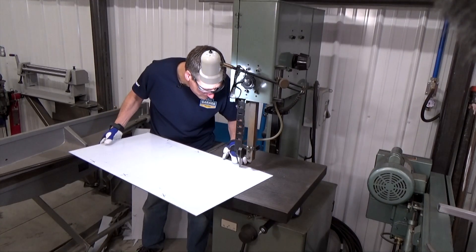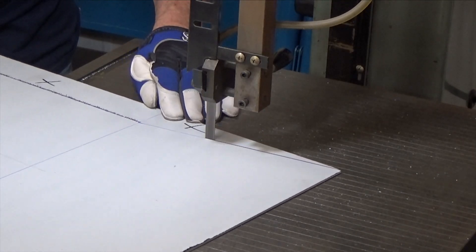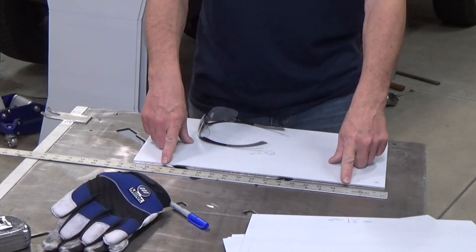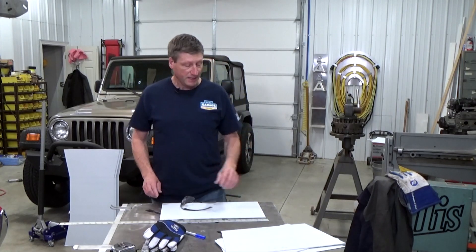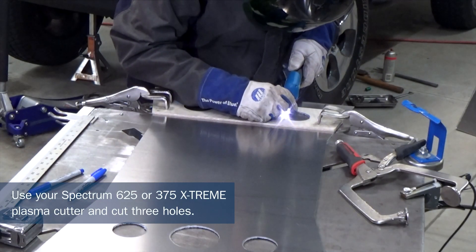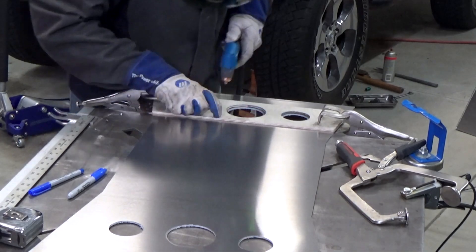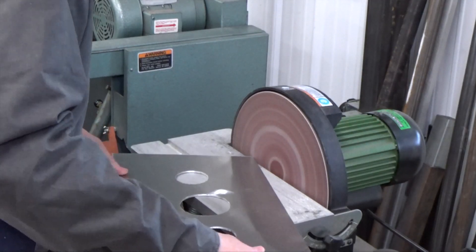I'm using a band saw to cut these out, but a plasma cutter, jigsaw, or even a reciprocating saw works well too. Now take all your 19 by 10 inch side pieces and mark two inches in from the top 19 inch side and draw a line all the way down to the outside edge of the bottom 19 inch side. Cut that off and make sure all your sides look like this. I'm plasma cutting some holes in the sides — it lightens them up a tad, but really it makes it easier to carry and move them around. I'm cleaning up all my holes and rounding the top corners of my side plates.